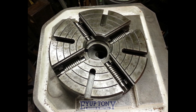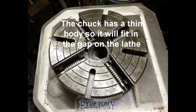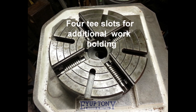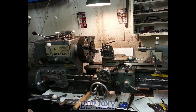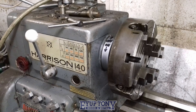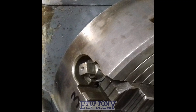This is the chuck body. It's a large chuck for this size lathe but it's a slim body chuck and it fits within the gap when the gap piece is removed. It's got four additional T-slots so we can use it as a face plate. These three pictures are of the actual chuck mounted on the lathe just to show you the size. It seems to have had a rough past life but once I machine it up it'll be good enough for what I need.